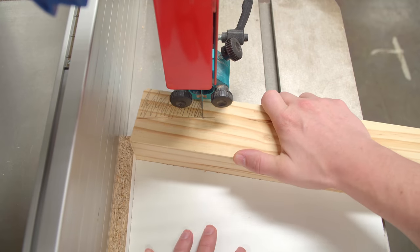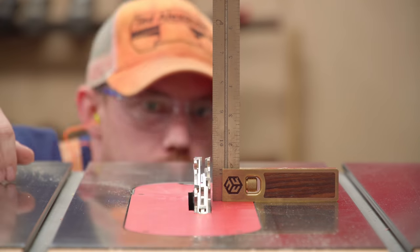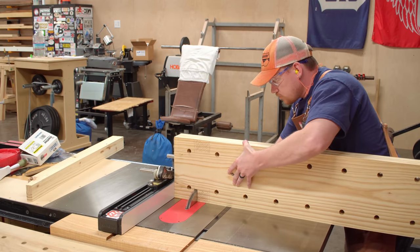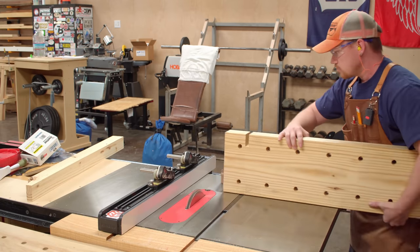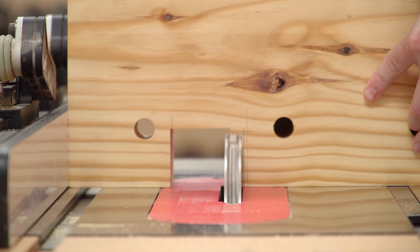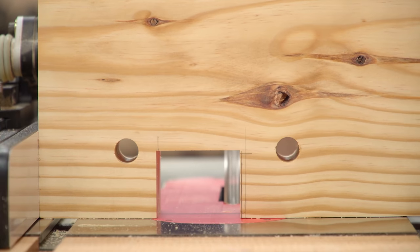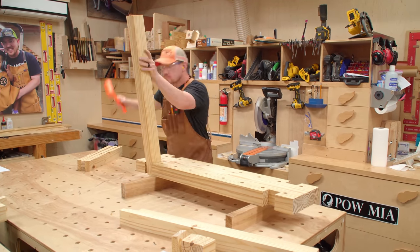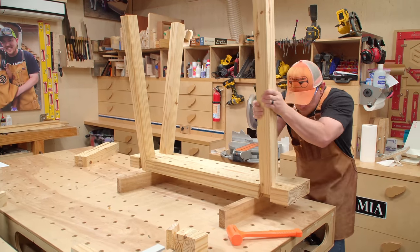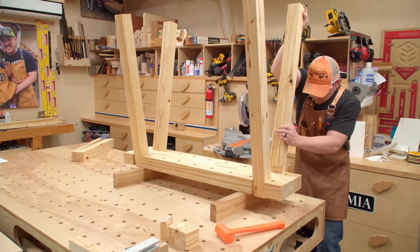No toggle clamps or hold downs necessary — it's just an angled reference face that rides up against the fence. After all the cuts are made in one direction the jig is rotated 90 degrees and the second cut is made, essentially creating a 90 degree corner on a specific angle from the length of the board. With the legs done I now knew the exact width needed for the top dados. I set up the dado stack for a three-quarter inch bite per pass. The fit achieved was borderline too tight, but I know the legs will shrink over time and I'd rather deal with a tight fit now than a sloppy joint later.